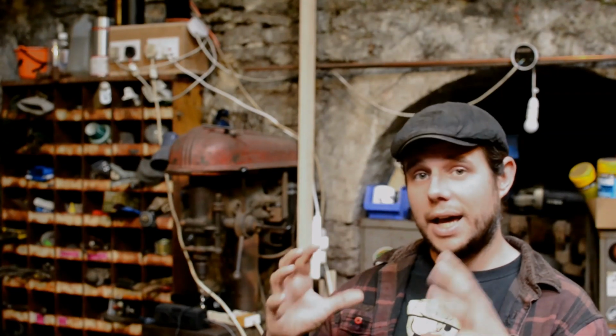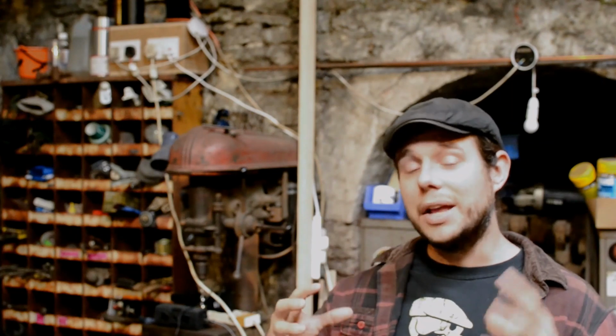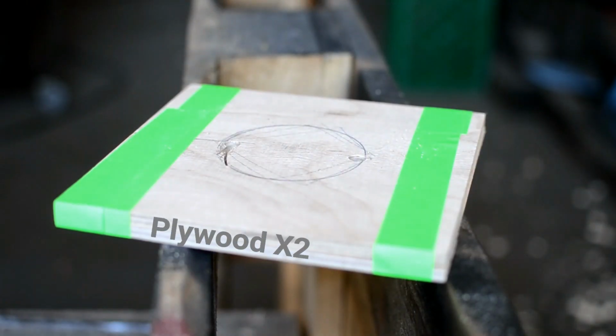So if you're trying to get things nice and hot, you need to make sure you've got plenty of air going in. That's why you've seen us working on the pipe work and on the blast plate with all the holes drilled into it. What that does is allows us to force air directly into where the combustion is actually happening. It means we can increase the rate of combustion. So if we're doing a barbecue, we can make a nice big fire, get that charcoal going and then spread it around and cook on that. Or if we're using it as a forge, we can increase the rate of combustion, getting the metal to the point where it's really nice and malleable.